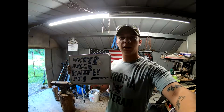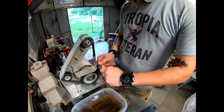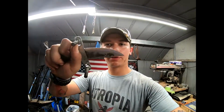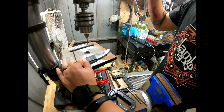Welcome, Berserkers. We're here on episode 4 of the Waterdoggo knife. What we're going to go ahead and do today is grind off the forge scale, put the handle on, and sharpen the knife. Let's get after it. Now that we have the blade about 90% of the way done as far as shaping goes, we're going to go ahead and put the handle scales on. Let's go ahead and start working on that.